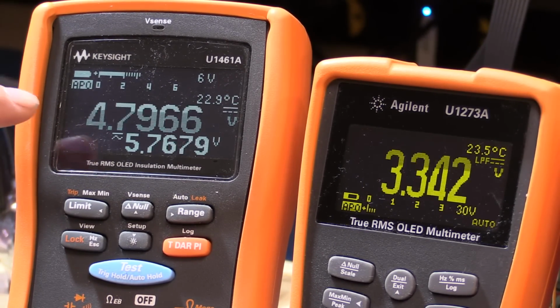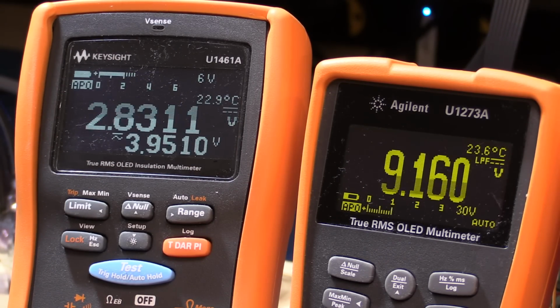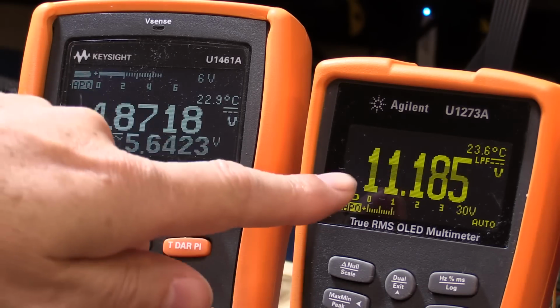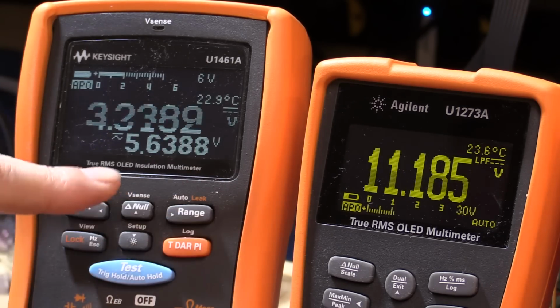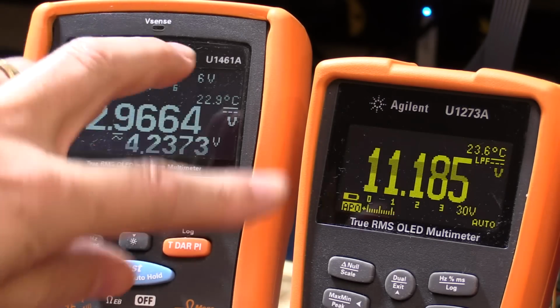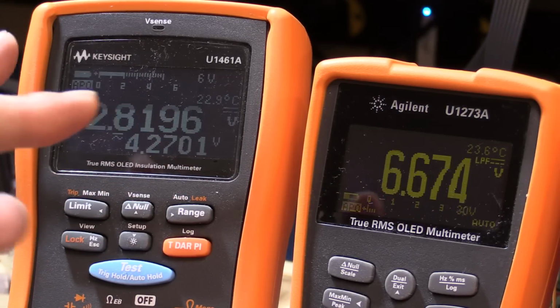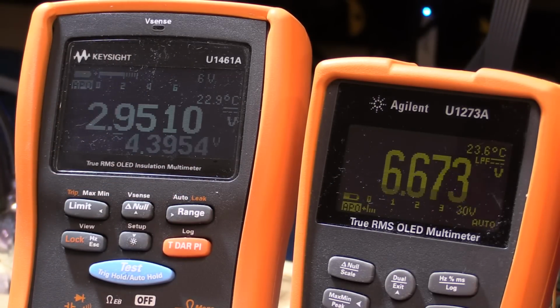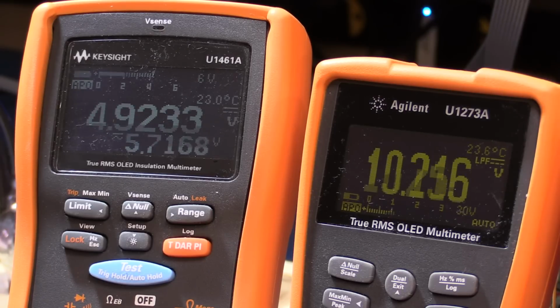output of the integrators, which feed through the diodes to pull down the gate of the MOSFET to turn it off. And as you can see, this one is hooked up to the voltage side. I think this one is hooked up to the current side. And you can see it's flip-flopping between which one is driving and which one is relinquishing control. And that's because my current limit is lower than my voltage set point to get the actual load. So it's kicking in as my load's going up and down.